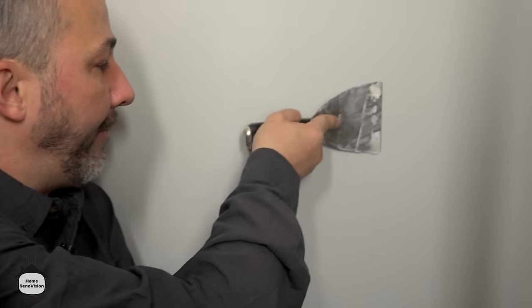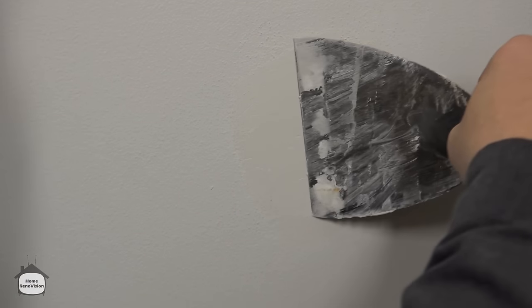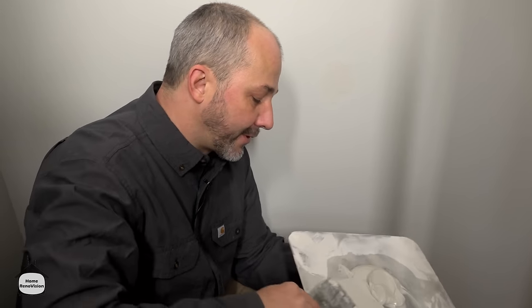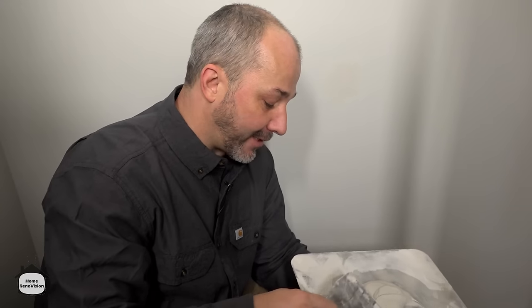Take a little bit of mud and press it in nice and thick. Because the middle hole might be a little big, leave a little extra on there. I've made it incredibly smooth so I don't have to do a lot of sanding — not using pressure over the middle so there's something to be taken off when it dries. Now we just wait 20 to 25 minutes. The rule for drying: 45 minutes with cold water, about 30 minutes with warm water, 20 minutes with hot water, five minutes with hot well water — well water has more minerals and accelerates the set. Make it in small batches or you'll be disappointed.